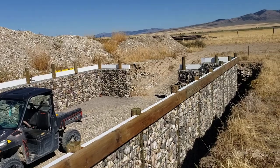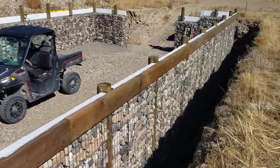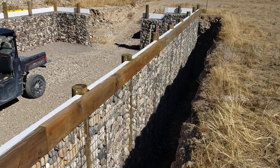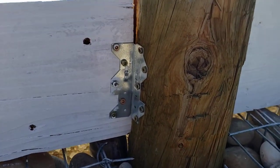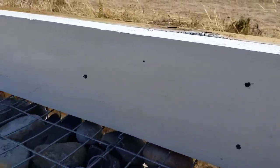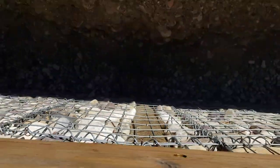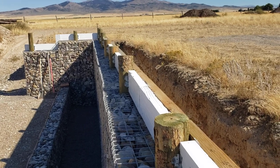Did you talk about how thick the lumber is here? Yeah, this front edge — since most of the weight of the building, it's one sloped roof — I went ahead and doubled up the timbers. And we went ahead and used hurricane anchors. There's a good shot of a hurricane anchor that we're using to attach these timbers, which I've doubled up. I'm stitching the inside to the outside and went ahead and put good six-inch screws there, as you can see. And that will be taking the bearing weight of the front of the trusses.